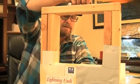This is a very strong piece of material that will protect against fish mouths and protect against the abrasion that could happen when the windows move side to side. Also just the landing of the window into the rough opening, particularly if you're working off scaffolding. A heavy window lands into the rough opening and as it's slid into place, the materials can get damaged. And the flashing corners can go a long way towards protecting you from that.